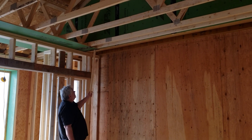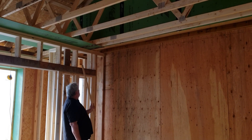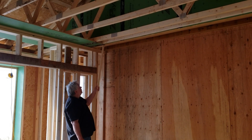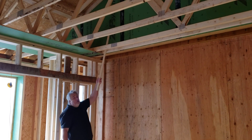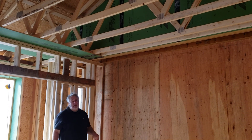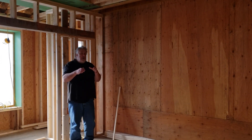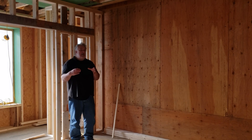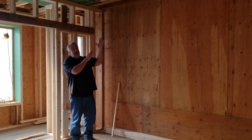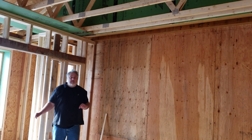We have that zip sheathing and it comes all the way down to that LVL beam there that frames the outer edge of the floor on the second floor. Our zip sheathing comes in and is neatly attached to the bottom of that LVL. So our air barrier goes up the exterior wall across the ceiling here, then it makes the transition to the two-story wall and goes up through that second floor, and then repeats that transition above the wall and across the ceiling on the second floor upstairs. Basically, you build the green box and attach all the unconditioned spaces — in this case the vented attic assembly. There's our green box continuity coming down the wall, across the ceiling, down the exterior wall.